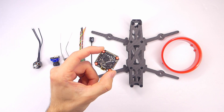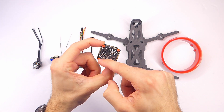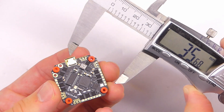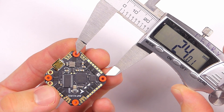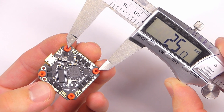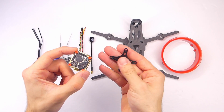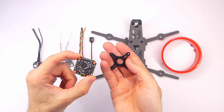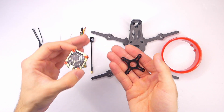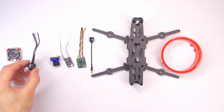This board doesn't come with mounts or mounting hardware, and it's a 25.5mm sized mounting hole board — larger than 20x20 and smaller than 30x30, a weird in-between size. So I created a 3D printed adapter that I designed, and I'll have the design available on Thingiverse and GrabCAD once I finalize it — probably by the time you're watching this video, so check the description. I'll also have the full parts list in the description below.